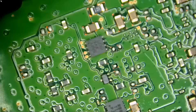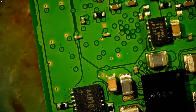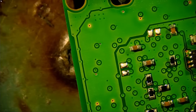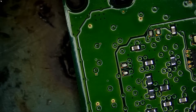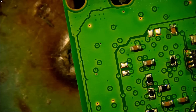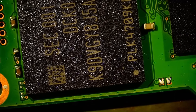Nothing stands out as being faulty based on visual inspection. Let's use our anti-glare light. Look at the capacitors — they are yellow in color under the anti-glare light, and they are washed out under the ring light. Big difference. Under the ring light, we cannot tell if that capacitor is an inductor, whether it's brown or gray. But when we go to our anti-glare light, yellow is yellow. So let's go ahead and inspect for a short circuit — randomly, any capacitor on the board.